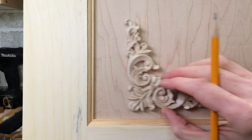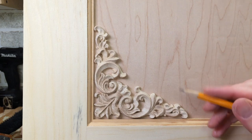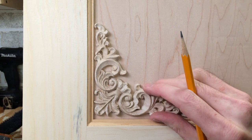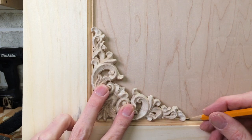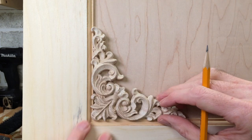The next step for the shabby chic detail is adding these corner decorative pieces. As I put this on, it sort of looks like it was added on as an afterthought. So what I'm going to do is actually cut away a portion of the trim — I mark it here and here — so I cut away that trim and it becomes integrated.